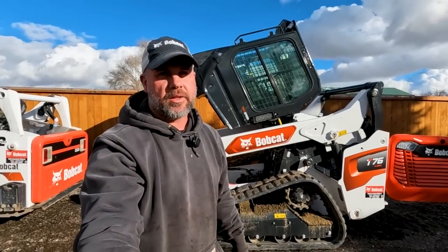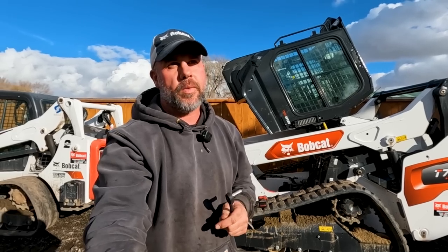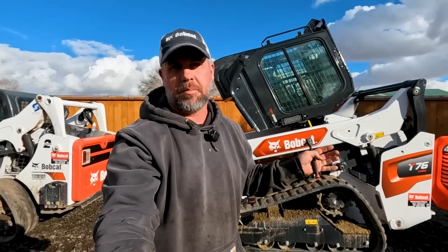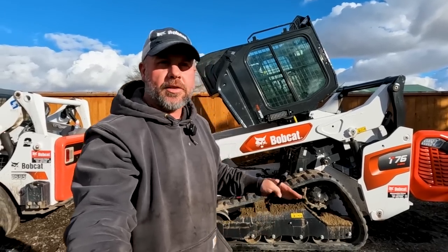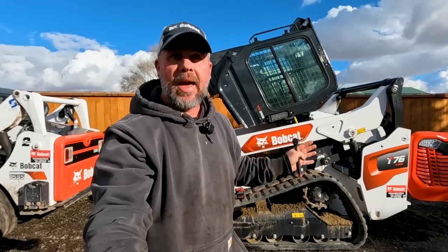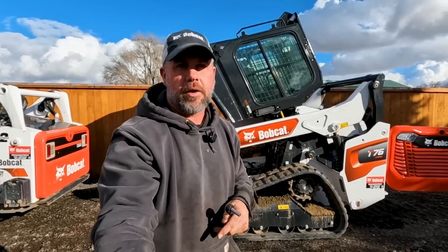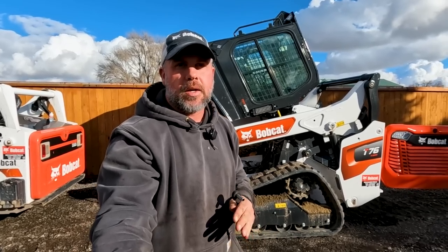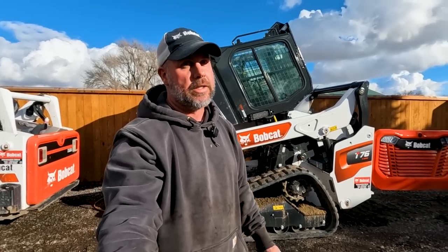I'm just going to bring the cab back down and put the machine back together and do a quick service on it. It just goes to show that sometimes electrical issues aren't as straightforward as they seem. If I wasn't familiar with Bobcat equipment and looked at this machine as a mechanic that's never worked on Bobcat, I wouldn't know about those water intrusion issues - that moisture can actually cause alarms to go off. That's why I went back to the hub controller a second time: the backup alarm went off first, so something I messed with helped a little, but the cab alarm was still on. That moisture was just so deep in that connection that it was making continuity between a couple of those wires, and that's what was keeping the alarm on. Bobcat doesn't necessarily recommend using dielectric grease - they say if those seals are not rolled in that plug, water should not get in there - but those seals looked good and water was in there, so go figure. Thanks for watching.